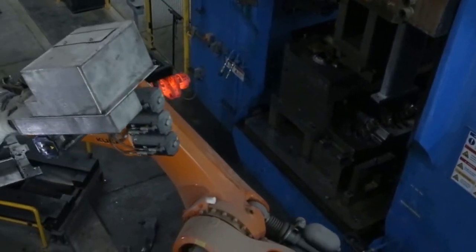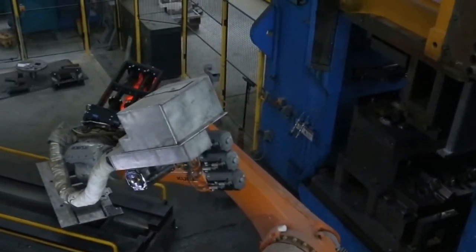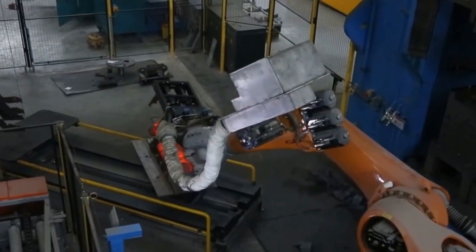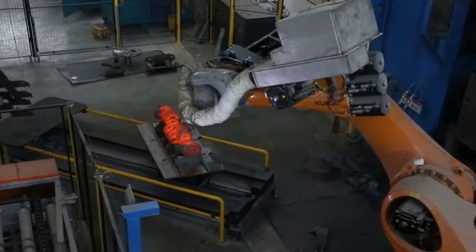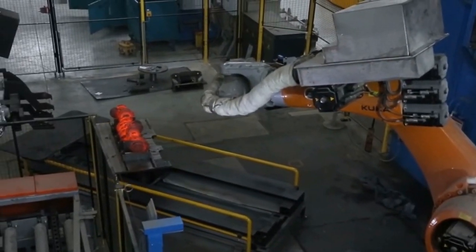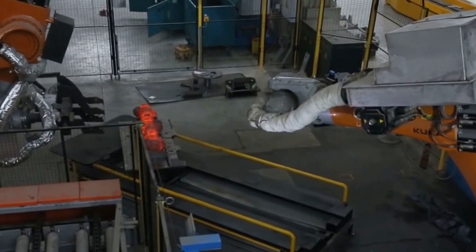It's like a cookie cutter. And basically what's happened there is it's a calibration die, because once it's cut free from the flashing, which is that squished-out excess, if it's the wrong size, it won't fall through the die.